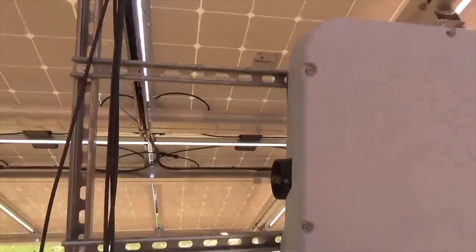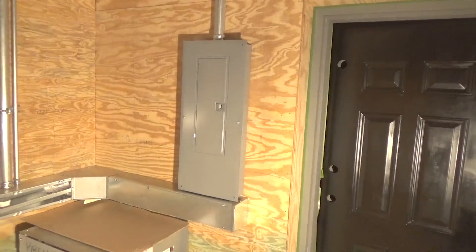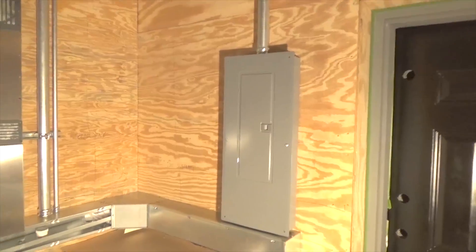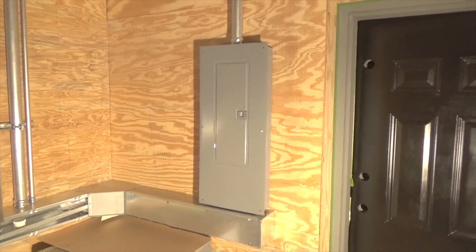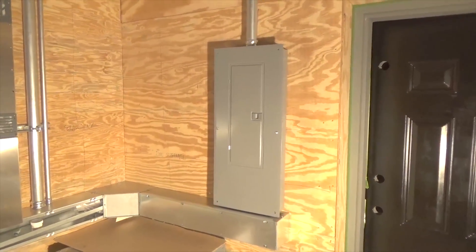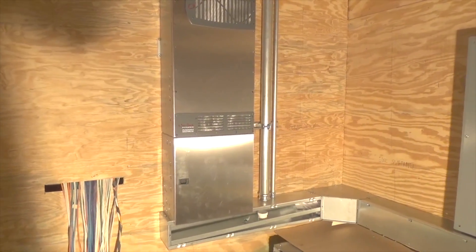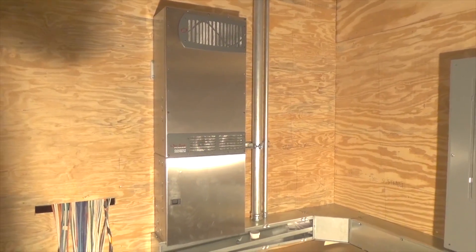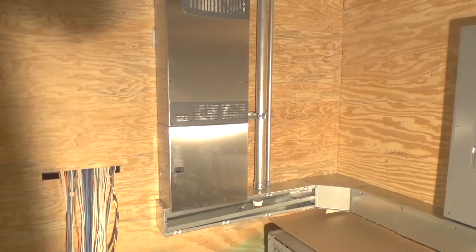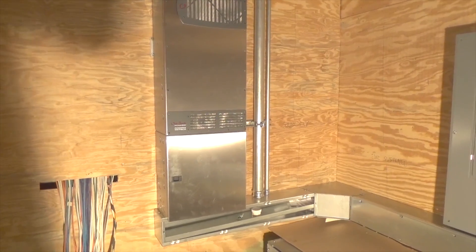In the mech room, roughing out for our critical loads panel. There are a lot of circuits in the house, so you have to negotiate with the homeowner to figure out which circuits they want on it — but we're putting well pumps, freezers, and food circuits on it. They have a really nice automatic generator going in here. One of the features of the Outback Radian: if the power goes out, we do not want to back-feed on the generator, so we need to sense power from the relays in the automatic transfer switch.